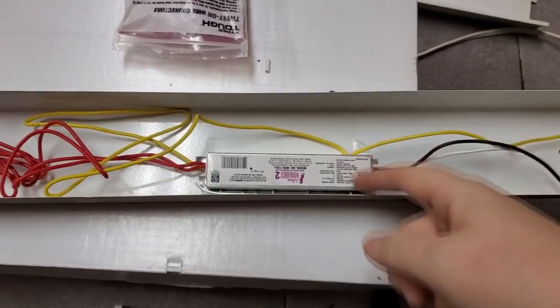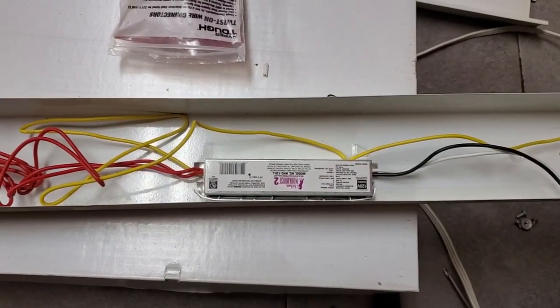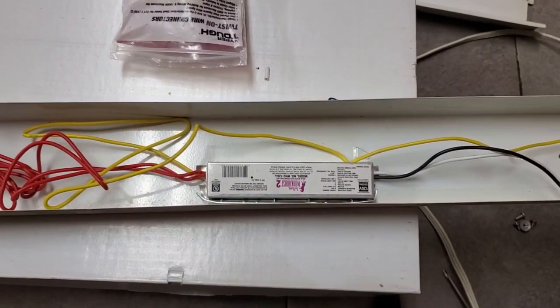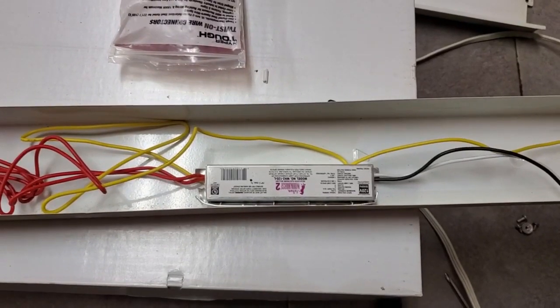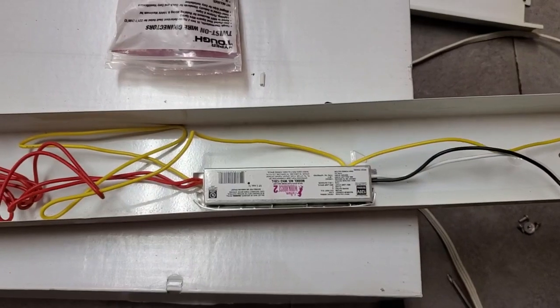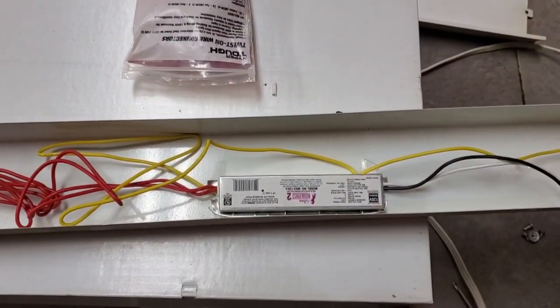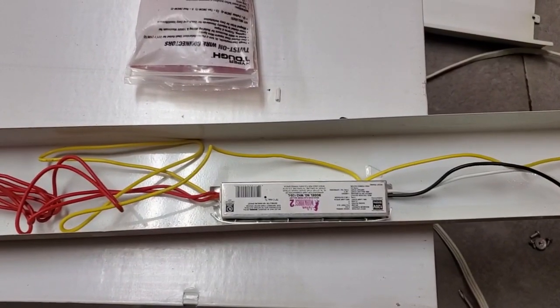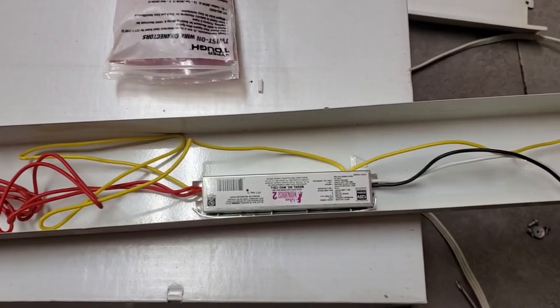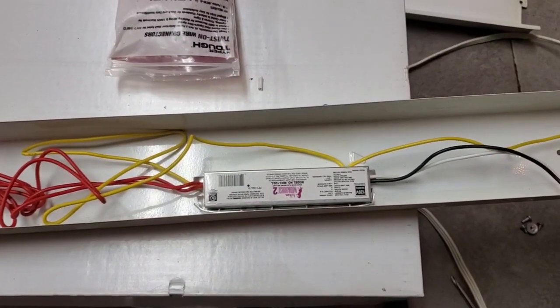And that's exclusively what I use this for. I've had it for years and all I've ever used it for is to kill dying fluorescent lamps. And it puts on quite a show while it does it. It's fun to watch. And it's certainly a good way of telling whether or not a bulb is still good. If it is still good, this will just light it up as normal. And it'll light up pretty much anything properly from a 4-watt T5 to a 40-watt T12.